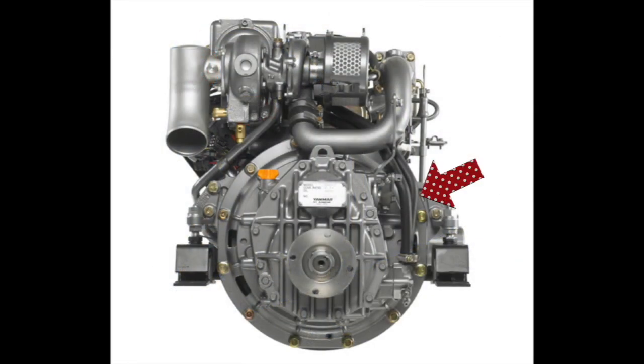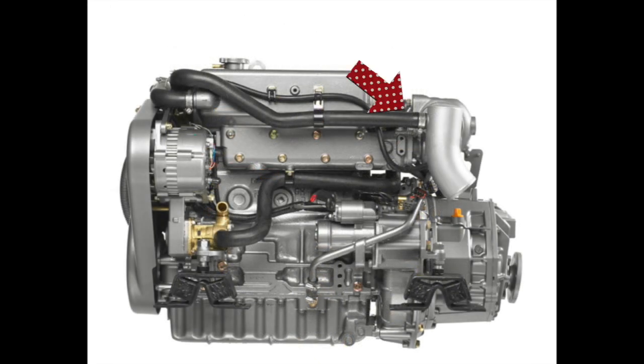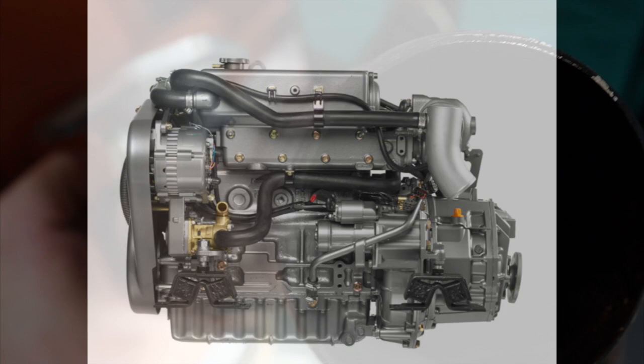While there's no seawater in the engine, we suggest that you clean out the seawater hoses, and these are quite difficult to track, but just follow the flow of the seawater and you'll see where they go. This includes the seawater pipe from the heat exchanger to the exhaust elbow. These quite often can be a problem. I'll let Ryan explain how he did it.